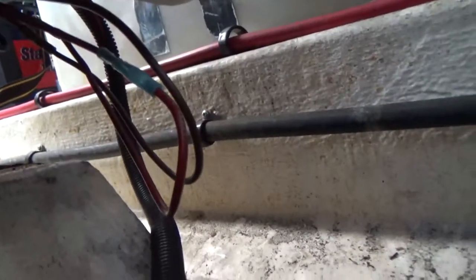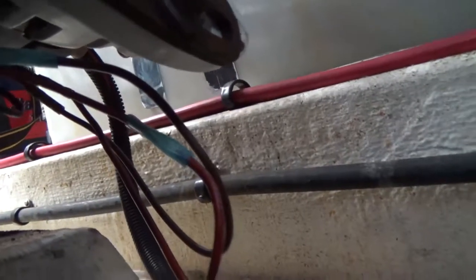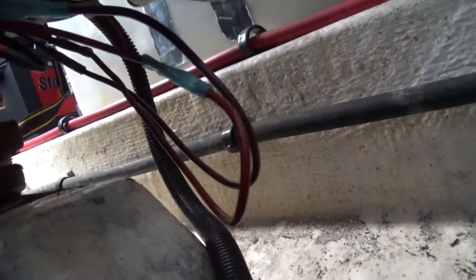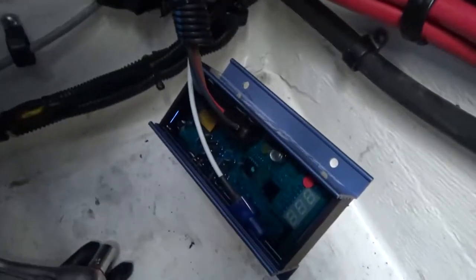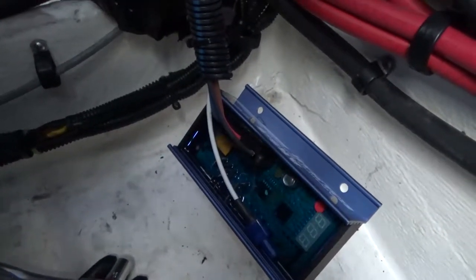It's always something. This is the wiring I've just installed. You can see it's really, really tight. There's a negative terminal on the bottom of the alternator there. And I had to make these wires extra long so I could reach over and actually put the butt connectors on. One's constant power to the regulator. The other one's the ignition switch that actually turns the regulator on. So the regulator's dangling right here, and I'll mount it to the wall here after I'm all done.